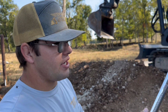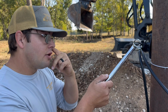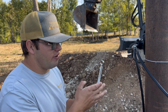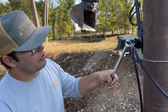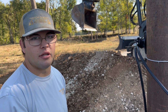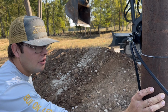The only point of it attaching here is so when you latch the gate, the hook goes in here. Once that gate latch hits this, it'll electrify the 20-foot gate. And when you pull the thing off, that gate will be totally dead. That way it's not just a nice little shock wire on the end of it to kill everybody with. We all know it won't kill everybody, but if you ever had kids, it'll hurt them pretty good.